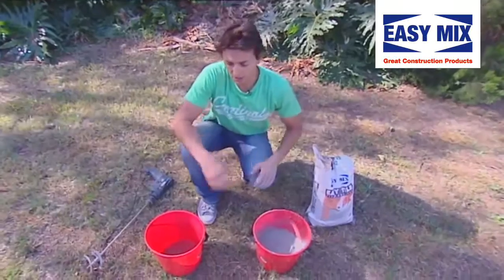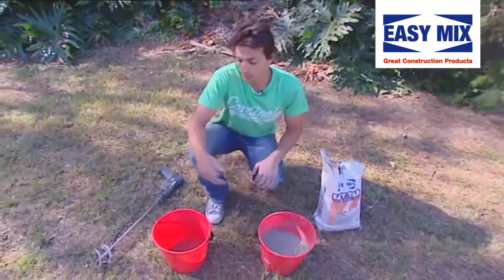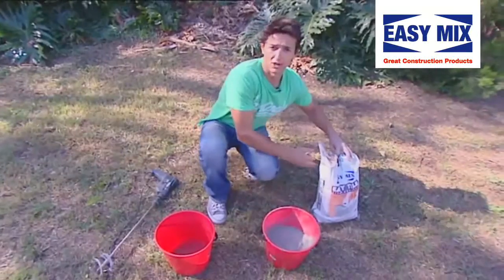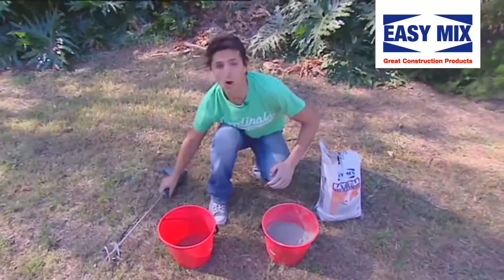Right, now once you've cut your tile, you need to mix your adhesive. I've got my easy tile adhesive here. Now my ratio, it's about a 4.5 kilo job. I've got a liter of water. The ratio for whatever job you've got, easily set out on the back. So again, important to take your powder to your water. Add it in slowly and use your spiral mixer.